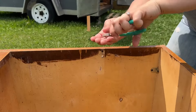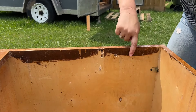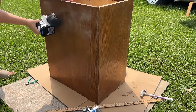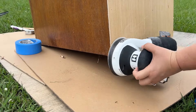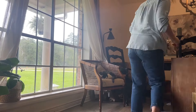We also made sure to remove any extra nails or screws sticking out from that centerpiece and made sure it was smooth and safe. Up next was prep for paint — we are going to sand this piece down, not to take off the finish, but just enough scuff sanding to be smooth and ready to hold paint well.